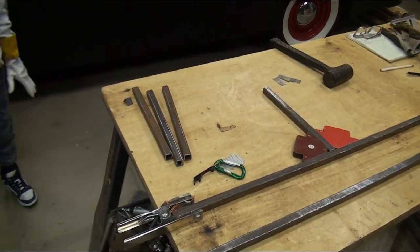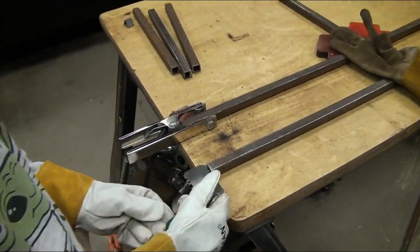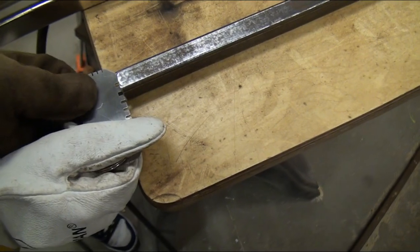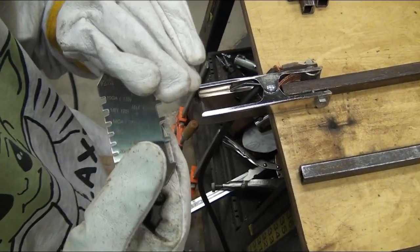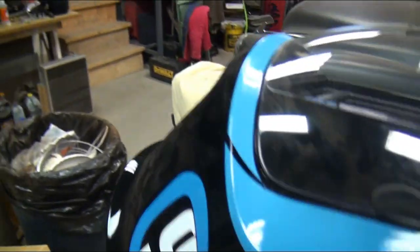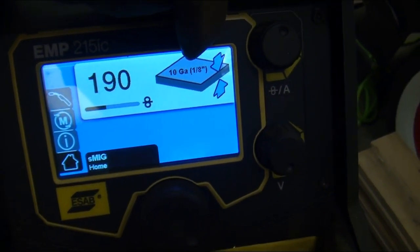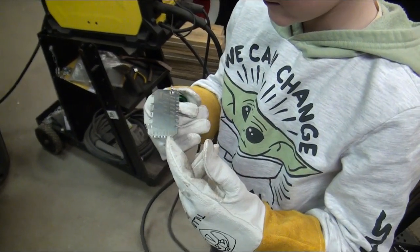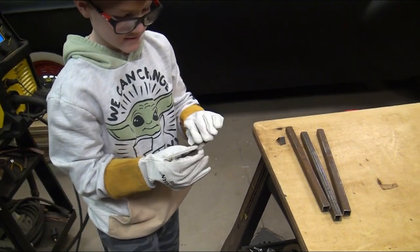This is the gauge — you use it to see how thick the metal is. See, it fits here but there's a little bit of space. The next one's too thin and doesn't fit. So you flip it over and it says it's one-eighth. So eighth inch. For this particular welder, instead of just having to know the amperage you need, we could set it at eighth — right there it says eighth inch. There are a ton of different sizes from the thinnest all the way to the thickest one.